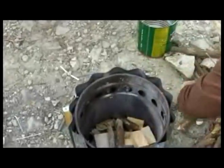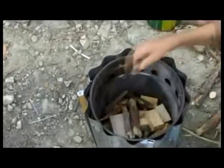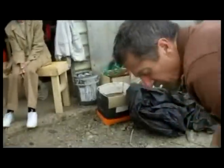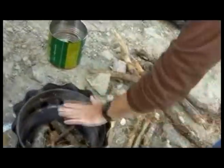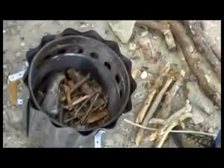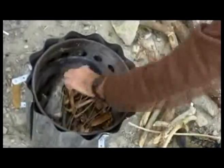Because of the temperature differential that our little tinder fire is going to create. One of the neat things about these stoves is you don't have to fill it all the way up to run it. We could put half of what I've just put in here and still successfully operate it and get it to gasify. If it's under 20% moisture content and it's an organic material — i.e. it has volatiles in it — then it qualifies as an input material. Now we've got our fuel load in here and we need some tinder, and it's important to do a relatively even tinder fire on top so that we establish a pyrolysis zone that burns fairly evenly.